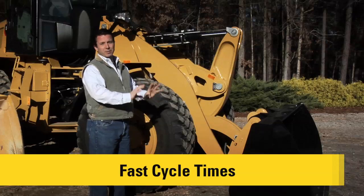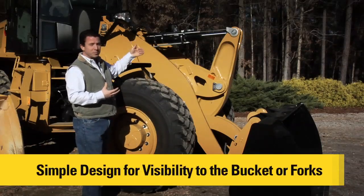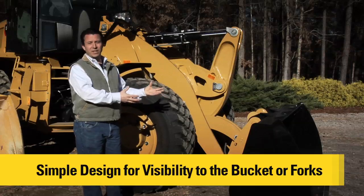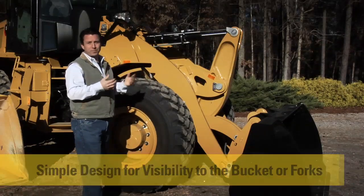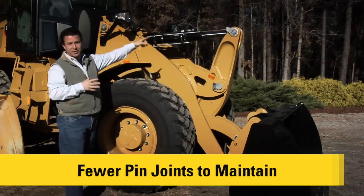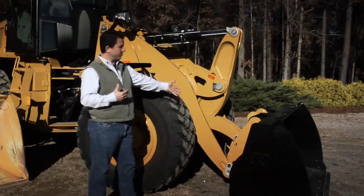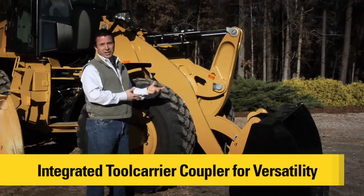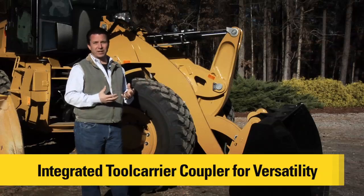The optimized geometry allows you to get in and out of the pile very quickly, just like traditional Z-bars. The simplified design also gives great visibility down to the bucket. We've optimized the visibility corridors to the buckets, and if you have a set of forks up front, you can see those fork tines through the carriage and through the coupler to see the tips as you engage a pallet. The simplified linkage means fewer pin joints to service, and fewer parts further improves visibility. Adding the integrated tool carrier coupler — also called the IT or standard coupler — lets you drop buckets, pick up forks, pick up brooms, hook up hydraulics, and get all the functionality of an integrated tool carrier.